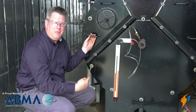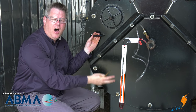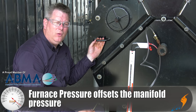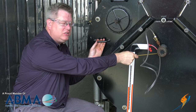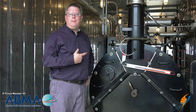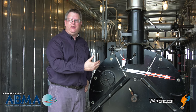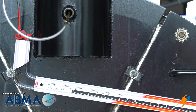Furnace pressure is an important measurement for combustion setting as well, because the furnace pressure offsets our manifold pressure to a certain extent and has to be taken into account when we're estimating the firing rate. We take that measurement off the back of the combustion chamber with a tap, and in this case we've got about an inch of furnace pressure — also referred to as over-fire pressure. This manometer actually has a useful second scale on it; by rotating it we can measure draft and get an accurate reading of what the draft is at the outlet of the boiler. We're at half an inch right now.